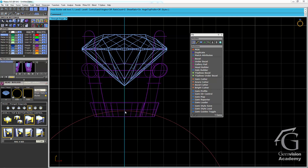Looking at the head setting here — it's eventually going to get cut through for the finger size, meaning all this metal thickness right here is going to be cut away. So the inside is going to be left quite thin. To ensure there's enough thickness after we cut through the finger, we're going to increase the thickness of the bottom rail. Before I increase the size of that bottom rail, I want to first create a guideline line to work to.